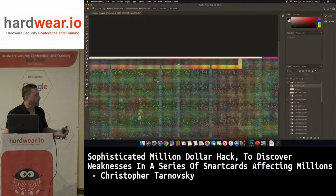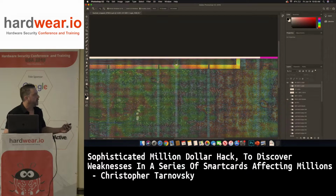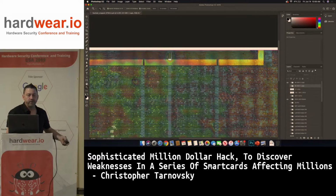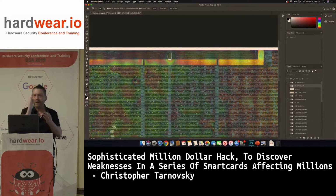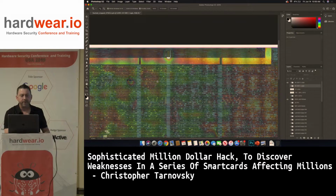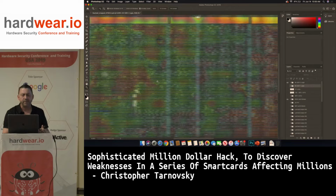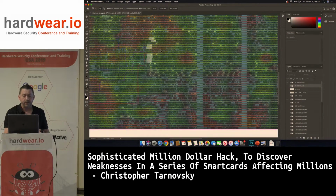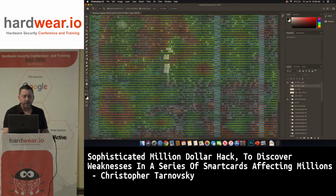It all depends on time, really. How much time is it going to take me? And imaging the EEPROM at this resolution would be almost insane, because every picture you take looks like the last picture. So the stitching software has trouble stitching these types of memories together, unless it knows exactly this many microns into the picture to align the 2 pictures. It is very hard to stitch memories, but Keyence makes microscopes that will do this. They do it very well. You can zoom in really high res.